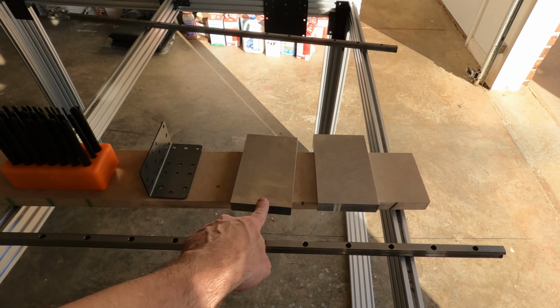A couple of quick updates before we get started working tonight. I had these six corner braces made and powder coated at work today, so they are ready to install. I'll remove this one here where I test fit, and we'll put all six of these on. That should stabilize the corners and make everything very secure. Once I have them all bolted in place, I need to drill these 1/4-inch holes all the way through so I can bolt through and sandwich all the aluminum to that plate, making that joint stronger.